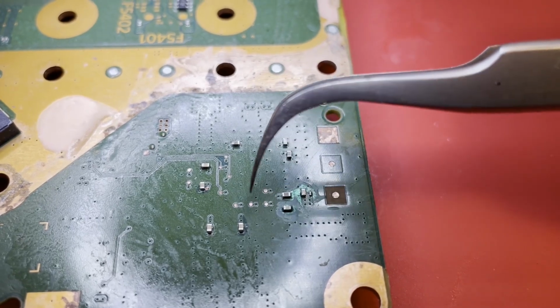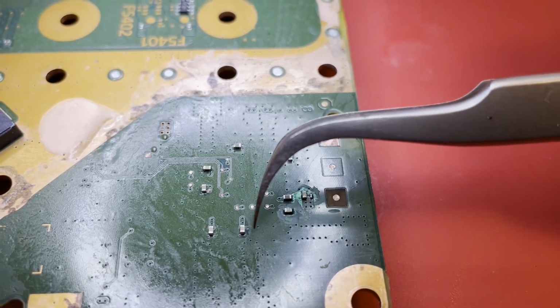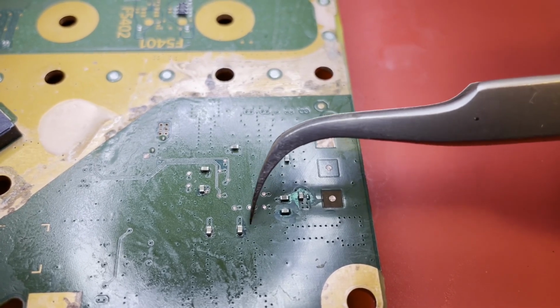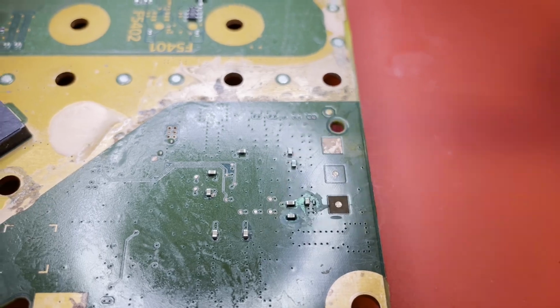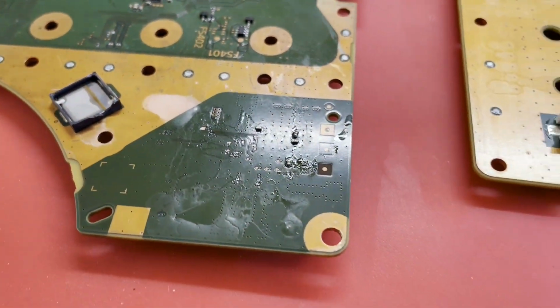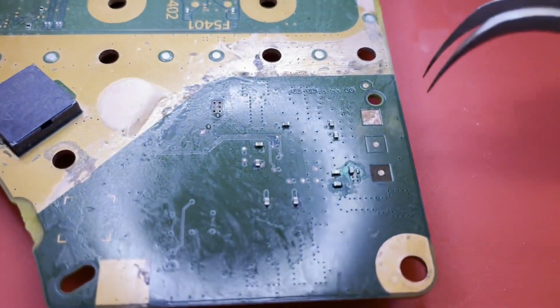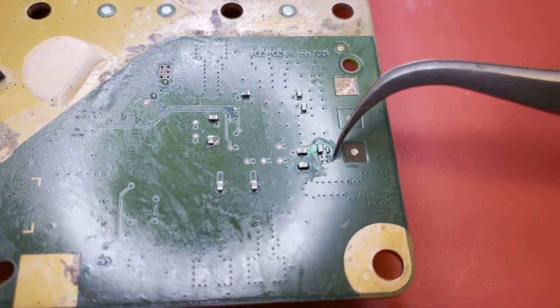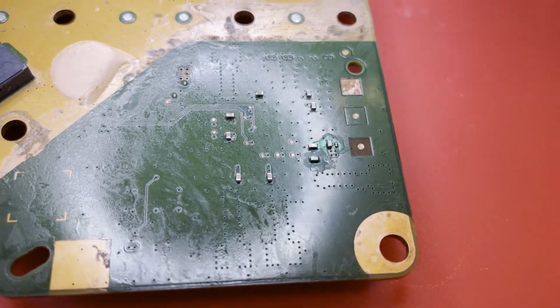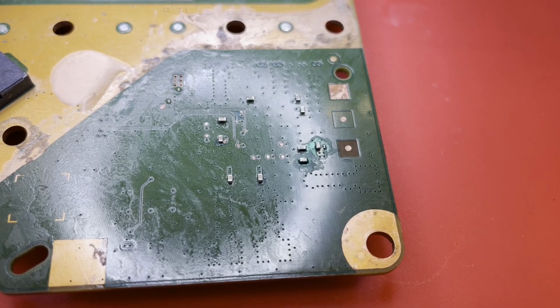And I thought I would have some. I didn't have any of that size. I think it's an 0402. I'm not positive, but an 0402 would definitely fit. And that's what I'm going to order going forward. But these came off a donor board over here, of course. That's where I pulled them from. And these were all 10s except for this one right over here, which was a 0.1 microfarad. So anyway, those are all replaced.